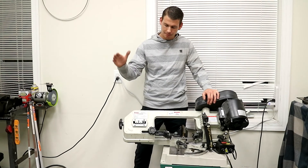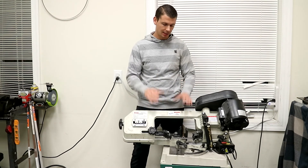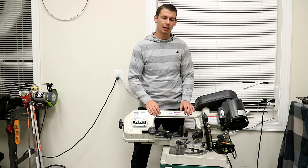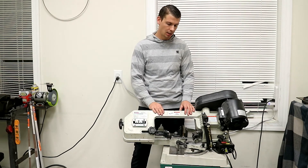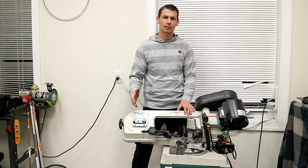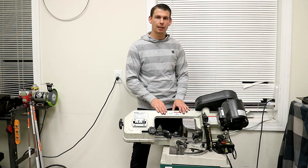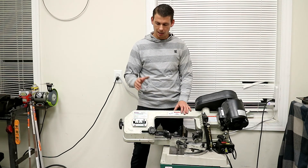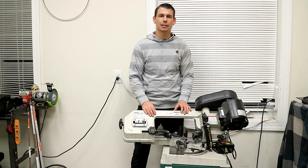That's pretty much going to wrap up my review of this Grizzly metal cutting band saw. I wanted to do this Tech Tip because this band saw has been invaluable to the shop — we use it every day, whether cutting stainless steel, aluminum, intercooler piping, exhaust, you name it. I know some guys say you need to run a wet saw for stainless and harder alloys, but that's simply not the case. As long as you have a good blade and you're slow with the down feed, you shouldn't have any issues. Subscribe, like the video, and we'll catch you guys in the next one.